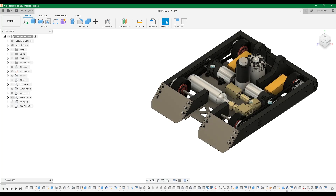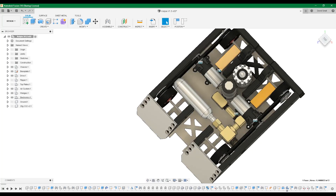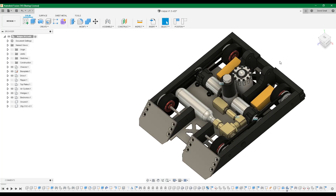The electronics are kind of just thrown about wherever there's room — I don't have them CAD'd. The robot uses two 2S batteries in series to make them 4S, which gave a decent drive. But I would absolutely love to get four motors in here to get redundancy like the Highlander has, and also bump up the speed a bit.